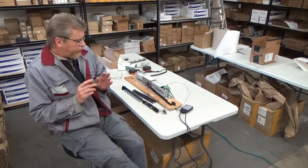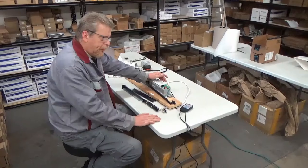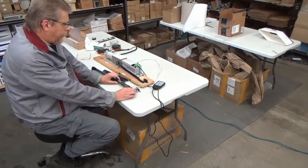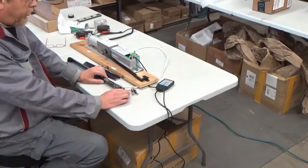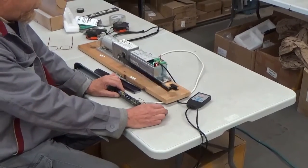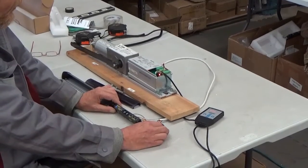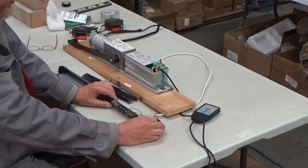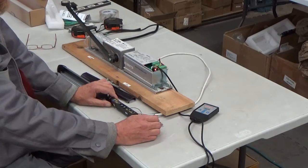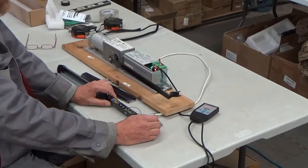The M227L is a nice looking unit, kind of cramped quarters. I'll supply a wiring diagram at the end of the video, but it's pretty basic: red is 24 volt, black is your ground, brown will go to sensor, and yellow will go to common — and that's pretty universal with the Allied units.